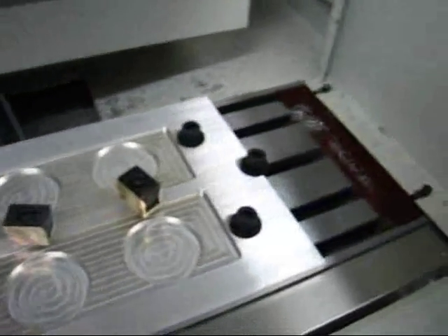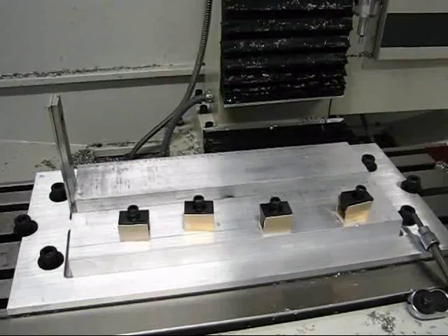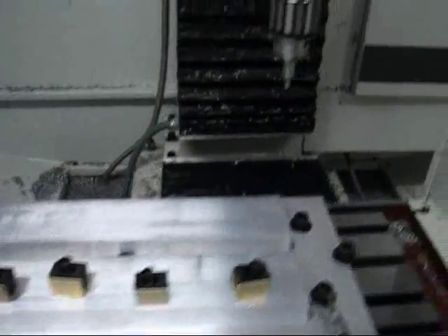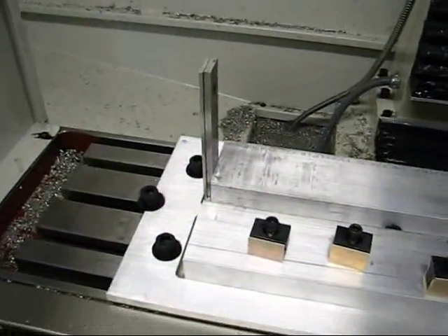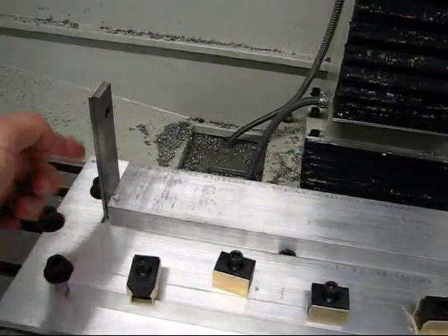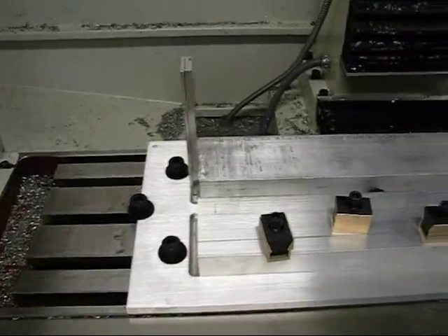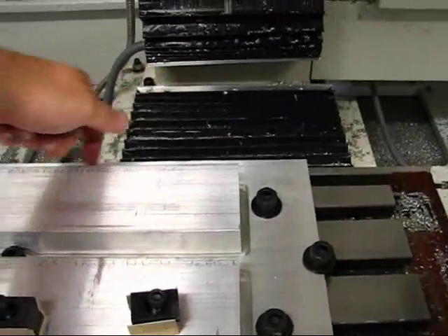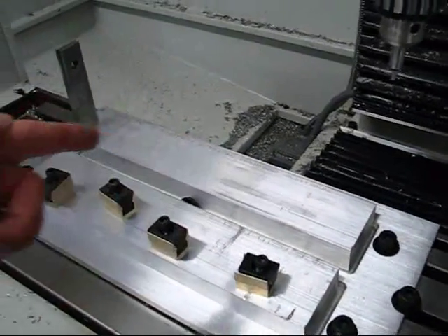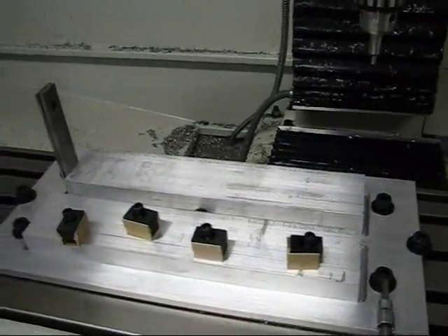The fixture plate is attached but it's loose, so I can wiggle it around and reposition as necessary. The fixture is sitting on the table, bolted down with two pieces of stock on it, waiting for the clamps to go in place. I set the X0 and Y0 — the X0 being the edge of this pocket, where the machining model has the zero floating off the end of that, so setting X0 by the fixture will locate it properly on the stock. The top of the pocket was used for Y0. It was an iterative process, checking both ends repeatedly. It took about five minutes total to be satisfied with the positioning.